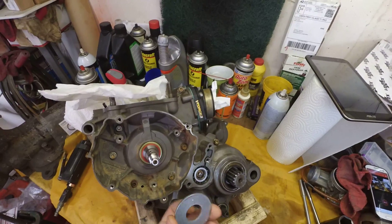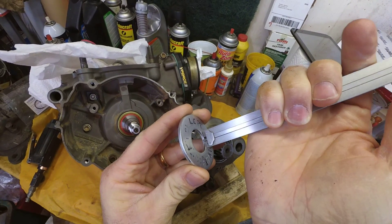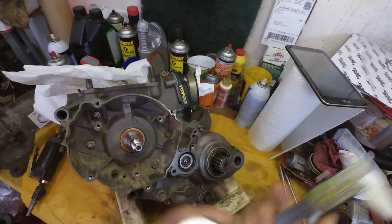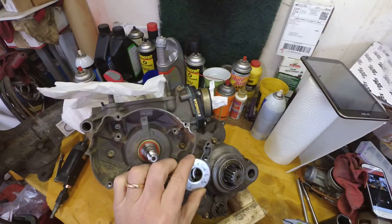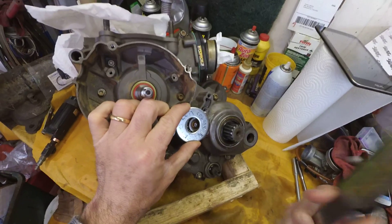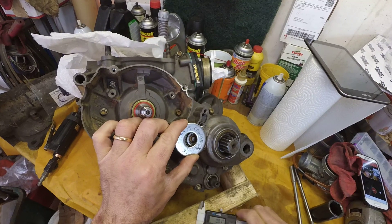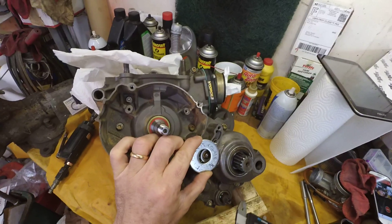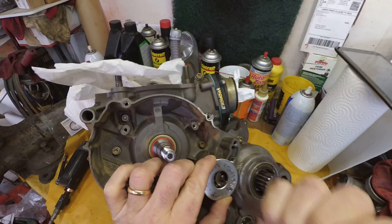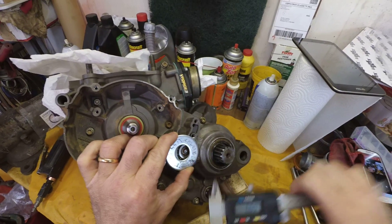This whole surface is flat right here, and I like using this washer because I can put it right there and then slide the center piece of the caliper out to touch it. First you have to start out by setting it at zero. I am going to put the washer on the flat surface, take the caliper, put it right on there and base it out — all I did is put it flat on the washer and slid the center out until it hit that base. Then I zero it, so now I am starting out at zero.